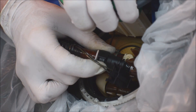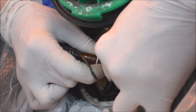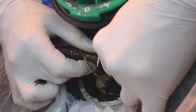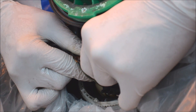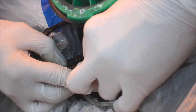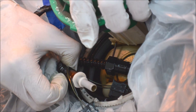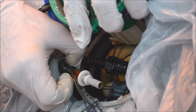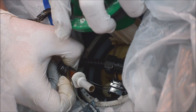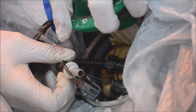There's a button right here — after you get that brown clip off, you might get a little spray of gas, but that line will come off. This is the high pressure fuel line. On the non-S, there's a Schrader valve on the fuel rail that you can use to relieve the fuel pressure easily, because you can easily access the fuel rail.